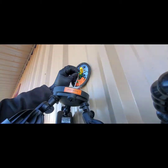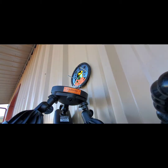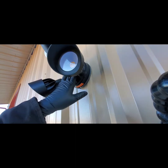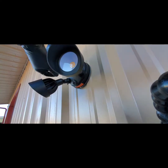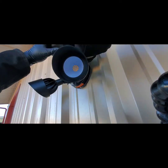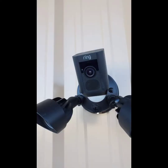Now that we've got the wires all hooked up — positive to positive, negative to negative, neutral to neutral — and got all those connections nice and tight, you can see that I'm stuffing them back into the container and the lighting fixture. One more thing that little orange-handled screwdriver does: if you remove the bit out of it, it actually becomes a nut driver, and it drives the nut that mounts the actual light to the housing and fixture. Those two little nuts right there — that's exactly what it does.